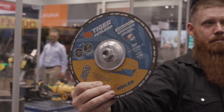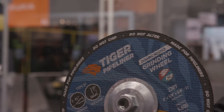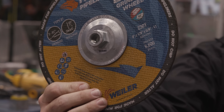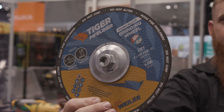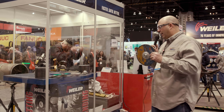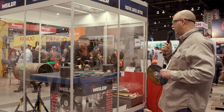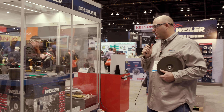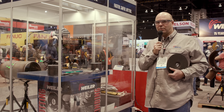What we've seen from being out in the field is products that have been out there for years glaze over on hot welds. What people do is they'll take a file and chip it, cutting little grooves or scrapes into these wheels to make them cut faster or to dress them. That's definitely not something you want to have to do. With the Tiger Pipeliner wheel, you don't have to do that. So as Jason suits up and gets his safety gear on, he's going to be grinding what's called the root, or bead grinding.